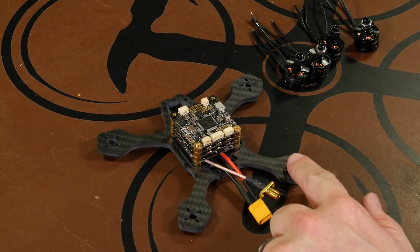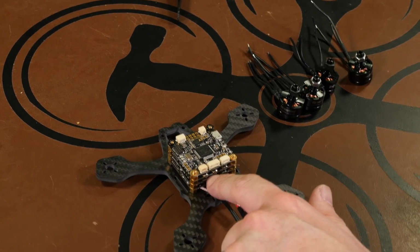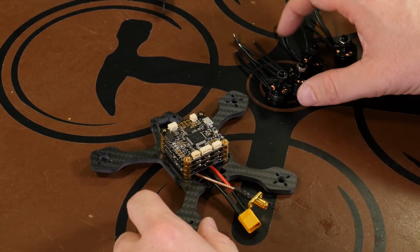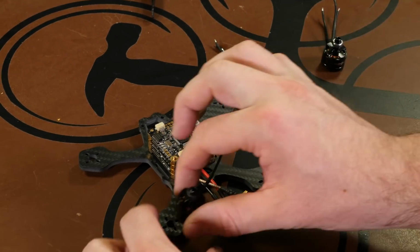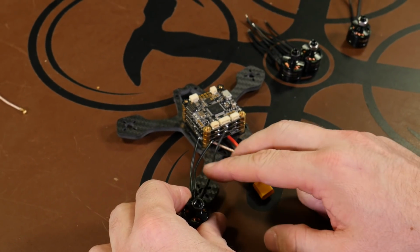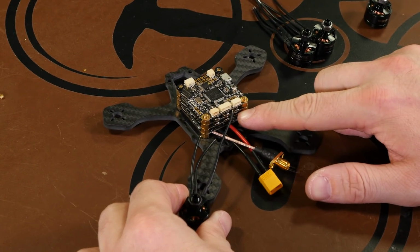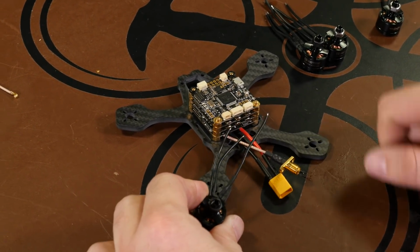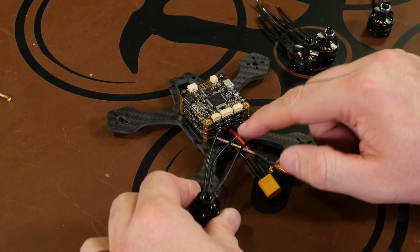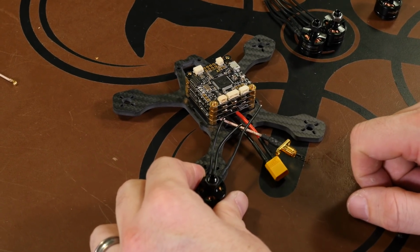So motor number 1 will be the top pads, and motor number 3 is going to be the bottom. And since it's going to be easier to work from the bottom to the top, we'll start with motor number 3. And it'll be a black nut. It's going to be number 3. And then motor wire 1 is the one with the extension. It's going to be going to the furthest pad. And the other 2 will be just in line. So furthest pad, middle wire will be going to the middle pad, and the far left wire is going to be to the far left pad.